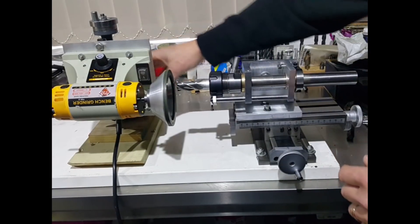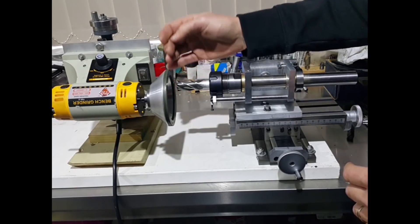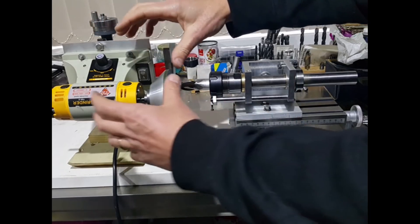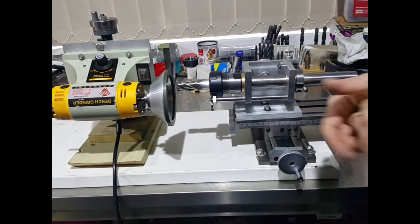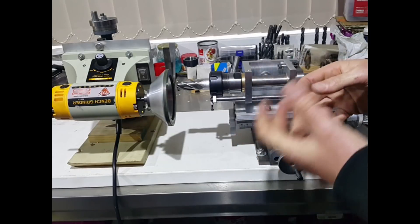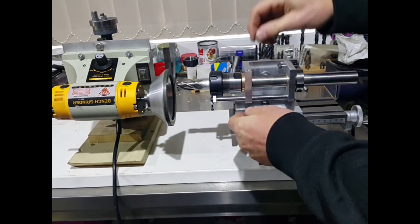At the back here we've got a lathe milling attachment which will allow me to wind the grinding wheel up and down, and also on the mount here that will allow me to rotate it if I want to do different things and different sorts of cutters, because not every cut is the same — they have different tooth profiles and various things.